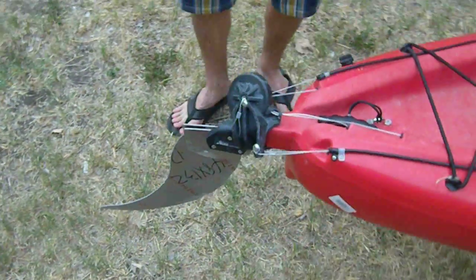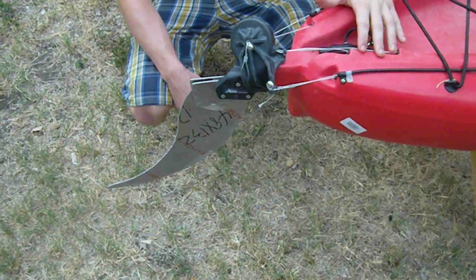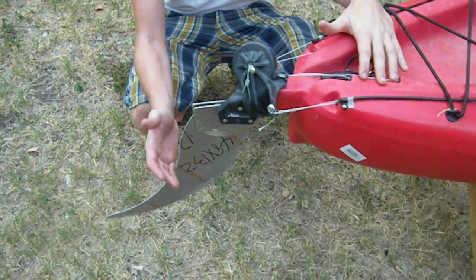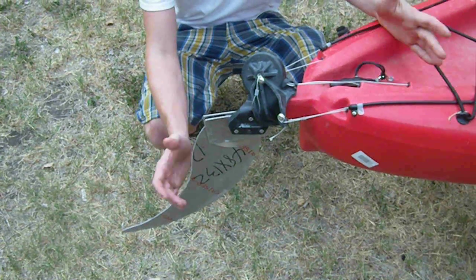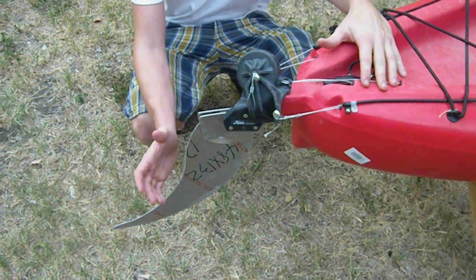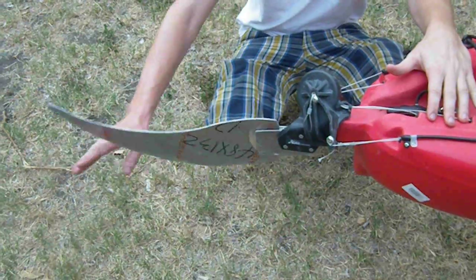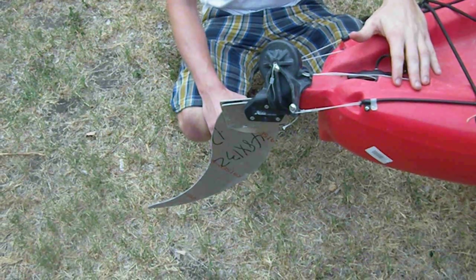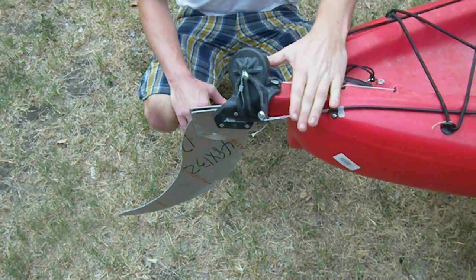The rudder itself is actually pretty unique. Moving back here, shallow water again is the problem. Most of the things that we did were to deal with shallow water, but this is an aluminum kick-up rudder, and the idea behind it is that when you come up on a rock, you don't actually have to put the rudder up, because a lot of times you don't see the rocks and they're coming at you pretty quick. When you don't have control, you're more likely to hit stuff anyway, so you basically want the rudder the whole time. The rock comes along, hits the rudder and kicks it up, but you don't lose control. You don't ever have to put your rudder up unless you're going in reverse, but that probably shouldn't happen. You can also see some of the dual rudder hookup.